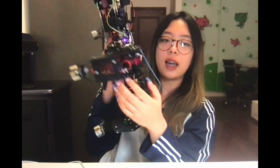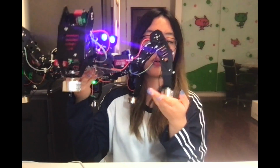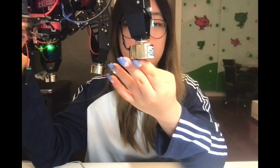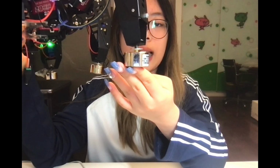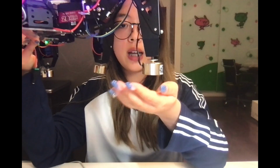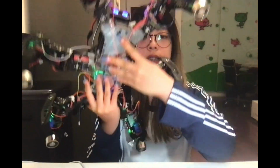And afterwards, I designed and installed the fake spherical joint, which is also one of the most important parts in the project. As you can see, this joint is made up of a screw, a nut, 2 gaskets, and 2 short springs to fix the electromagnet into the tail of the leg. The electromagnet utilized needs to be attracted toward the wall vertically. However, given the fact that the gait is self-designed, which inevitably contains error, and the gravity mass of the robot may influence the movement when it is climbing,